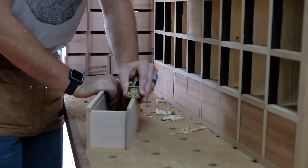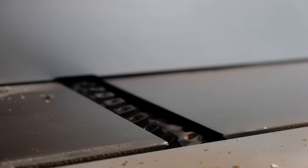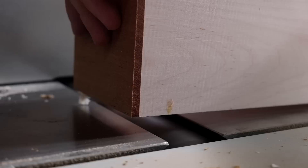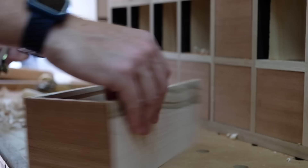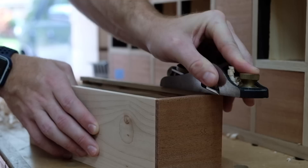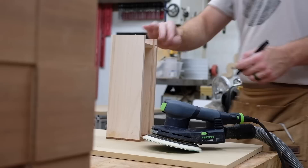On to fitting the drawers into their cubbies — this went pretty fast relatively speaking. First I'll chisel away any dry glue then flush up any edges with a block plane, doing frequent test fits so I can sneak up on the right fit. At times I'll use the jointer to remove material in that last 80% of the drawer, which gets me most of the way home with the rest handled by a plane. Using the jointer like this isn't the safest but it saves time and gives good results. As for wood movement — generally I assume any place these cabinets will go will be less humid than where I am in South Florida, especially since this was built in late summer and early fall, so the drawers should only shrink and not expand further. So far that theory has worked out.